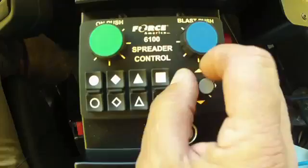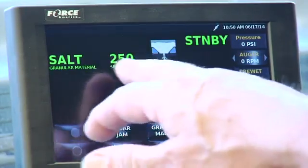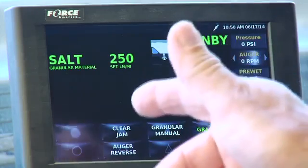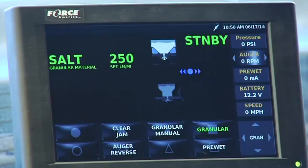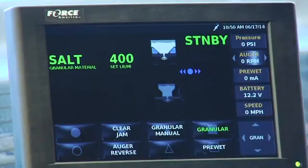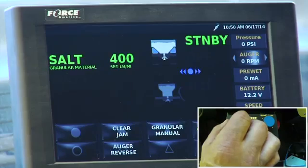So auger RPM, you know, if I'm looking at auger RPM and I'm turning at 250 pounds, this should say an RPM, whatever it takes to get 250 pounds in a single lane mile, regardless of my engine speed. I know it could be 20 RPM, could be 10 RPM. But that'll change as you change your rate, right? Then this RPM will change. It's basically another tool for the mechanics to see if you lost RPM.